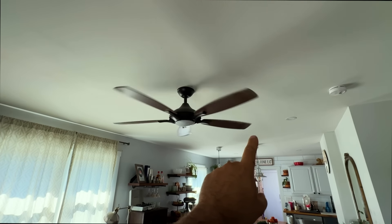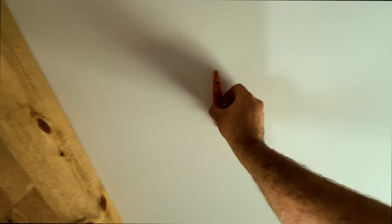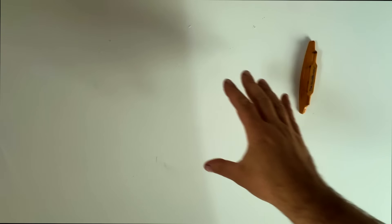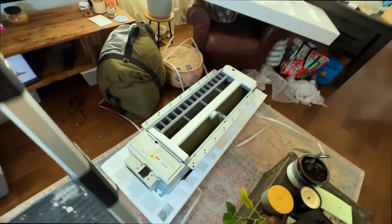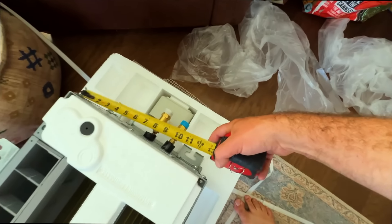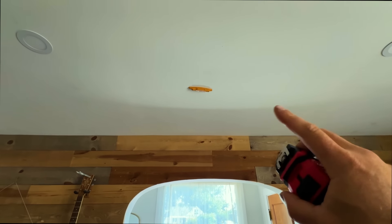This section is on 16-inch center — I can see a screw here and 16 inches over there's another one. On 16-inch center you have about 14 inches of spacing in between, so this unit will fit perfectly right between the studs. We have our perfect opening; we'll center it, mark it out, vacuum the insulation, and cut our hole.